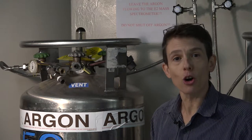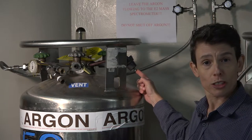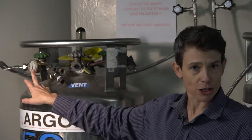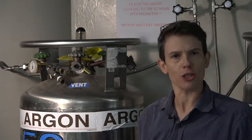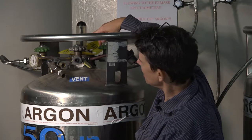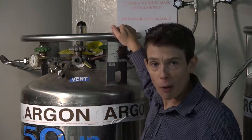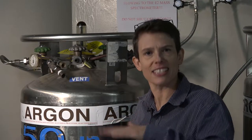If the pressure is too high — over 300 PSI inside the tank — you'd like to decrease the pressure a little bit. Same bolt: turn it a quarter turn counter-clockwise, then wait and watch the pressure decrease inside the tank. The pressure will take about five minutes before it settles into its new position, so you have to be patient. This gauge tells you how much liquid is in the tank. The little yellow strap is the level of the liquid. Sometimes tapping it slightly to make sure that the cuff has settled properly to give you an accurate reading is required.